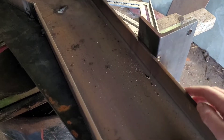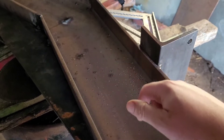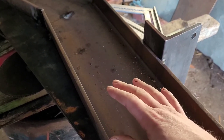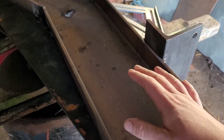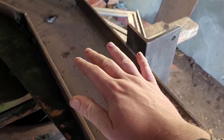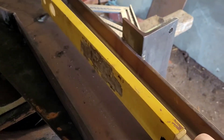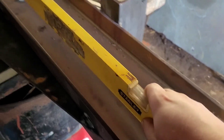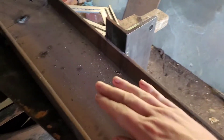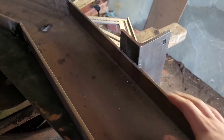We didn't weld there, but there's a reason. What we've done is we've got them in three barrels now — one in the middle, one over the side of the shed. It's dirt floors we're on, so nothing's level. So what we've done is we've jacked all them up so we've got the middle rafter straight and level. Then we've gone and leveled the rafter. There's a tape now and we're level. So we've got them all level, each of them, and they're the same height, so it means they're flat and straight.